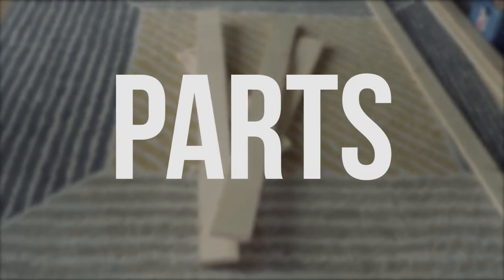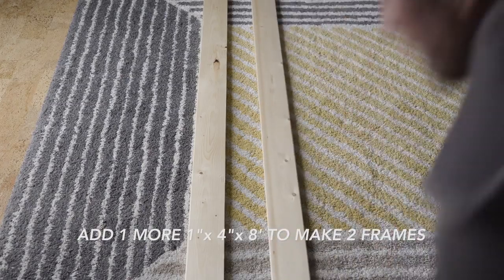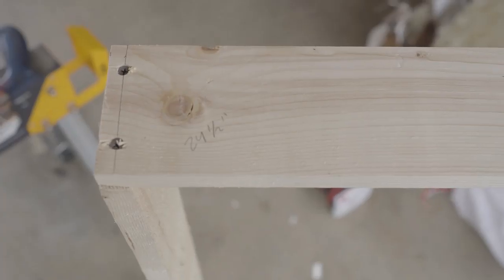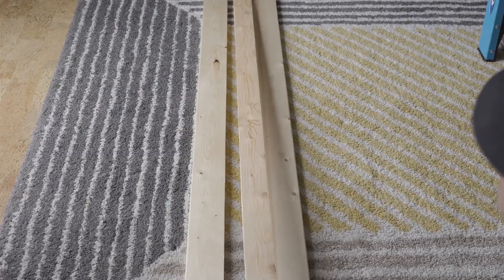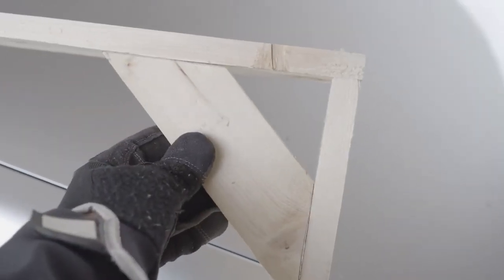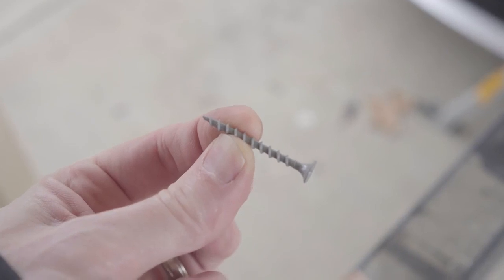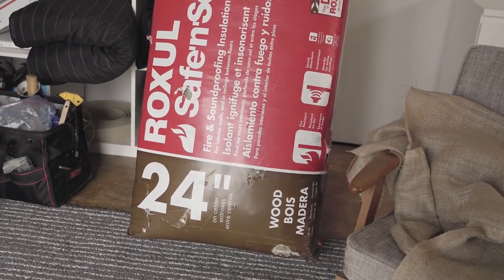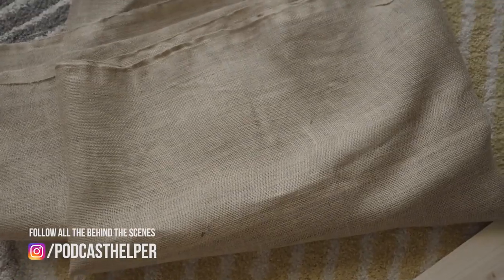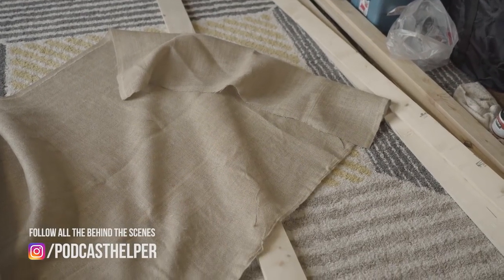Next, the actual materials for the panels themselves. To make one panel, I bought two eight-foot pieces of 1x4 common board — just cheap, lightweight wood. I'll cut these into the pieces of the frame: two 47-inch pieces for the sides and two 24.5-inch pieces for the top and bottom. I also bought a 10-foot 1x3 board that will be cut into the back brace pieces and four corner pieces for each panel. For the backing, I used breathable weed barrier fabric. A box of number six deck and fence screws, one and five-eighths inch long. Rock wool safe and sound insulation — two-foot by four-foot batts, eight per pack. And to cover the panels, I used burlap from a local fabric shop. It's very breathable, allowing sound to travel right through and into the insulation.